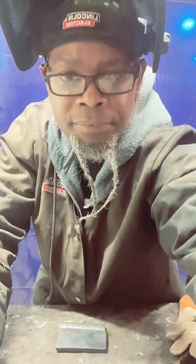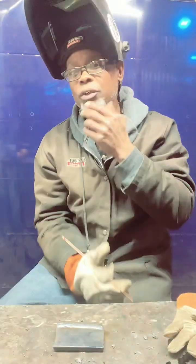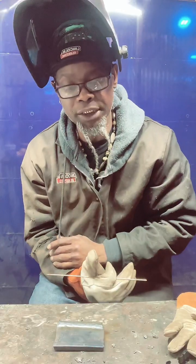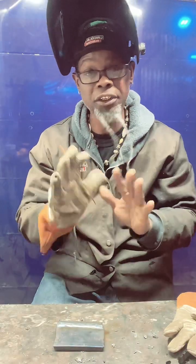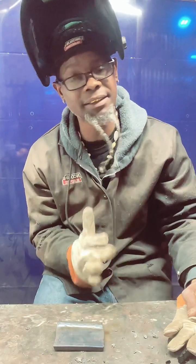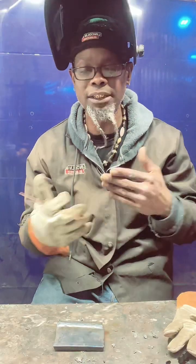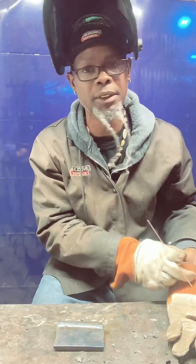Yes, you can. But if it's too long, you're gonna have to retake the test again. The main thing, family, with underwater welding, you're gonna have to learn how to dive and learn how to use certain rods. Other than that, you're just gonna be learning the safety of getting in and out of the water, the dive procedures, different rods you use, different gloves you have on. But the process is the same. So if you can stick weld pipe on the ground, you can do it under the water. The only difference is you're gonna have to learn the feel. It's a little different because you have water around your hands, but it's still the basic process, fam. So once you get it, you got it. You just got to learn some other things to help you critique your skills.